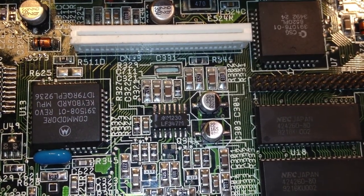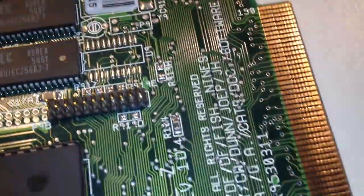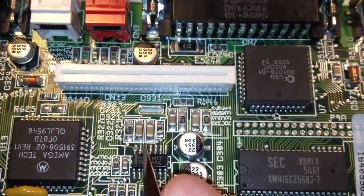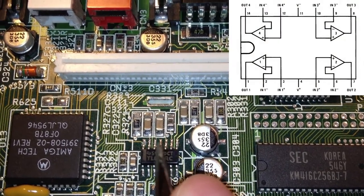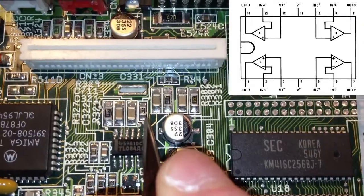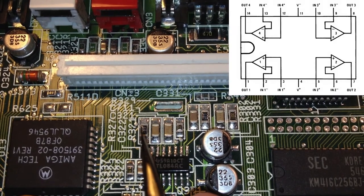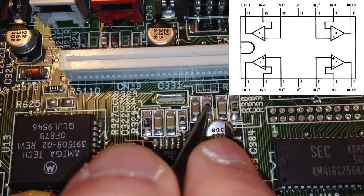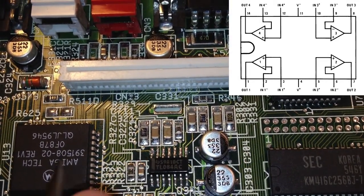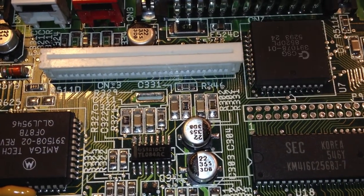Let's take a look at the other motherboard and see if we have the same resistors — and we do not. I checked it with a meter. Here is revision 1D, same op-amp chip configuration: output, inverting input, non-inverting input, minus 12V supply. Looking at the resistors here, it says 681 on this one and 681 on this one as well. And indeed, I got a reading of 680 ohms on both of them — different values of resistors.